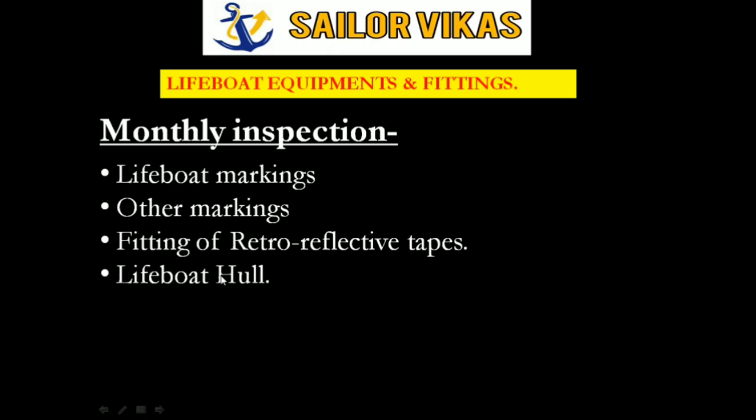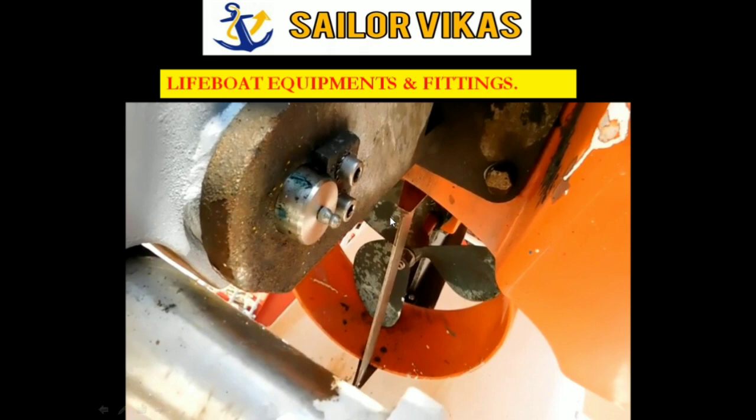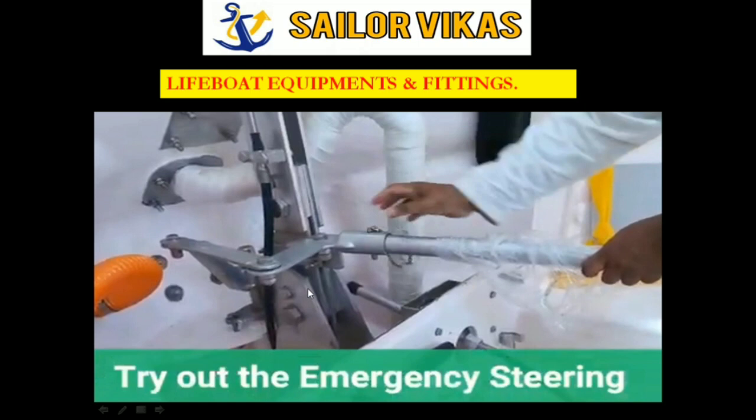Now I will come to the rudder and tiller. As you can see here, you should always inspect the rudder condition to make sure that there is no dent, and that there is a protection guard on the propeller and it is in good working condition. And this is the tiller. You have to try out the tiller monthly and make sure that you grease the turning areas wherever required. So you have to try out this emergency steering monthly.